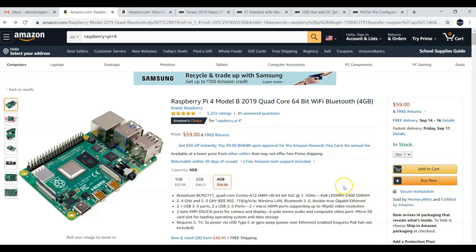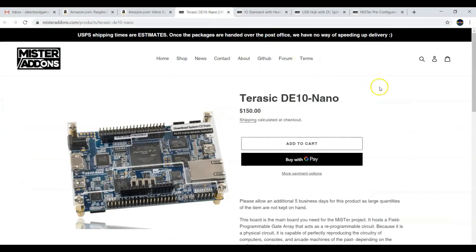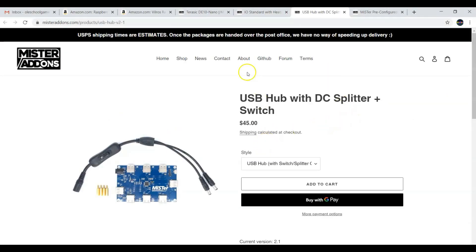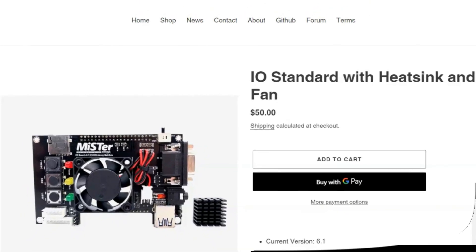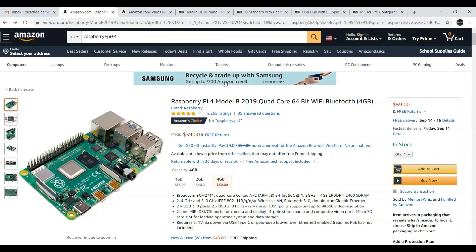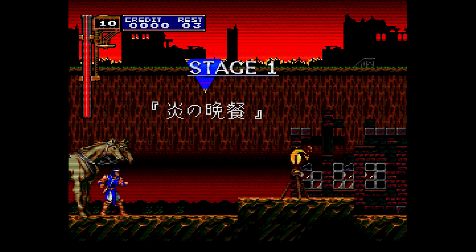You have to consider hardware options, because that's where the bulk of the price comes in. The Pi 4 can be bought for $40 to $50 depending on which model you get, while the MiSTer is broken up into several boards: the DE10 Nano costs about $140, plus another $45 for the USB hub, $60 for the IO board, and another $60 if you want the 128 MB of SDRAM — specifically for high-end games like Neo Geo's King of Fighters. You can also get full kits with all boards bundled together. The Pi comes fully assembled, and even cases or kits don't require soldering — they're pretty easy and cost a fraction of the price.